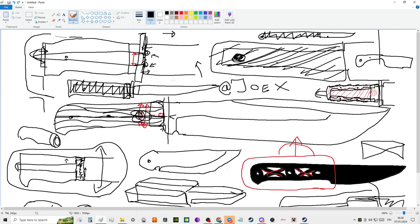But the neat thing with katanas is they have this thing where they insert the soft metal in the spine of the ingot or your billet, and they forge that out. That's actually why you should never do sanmai on really large blades, because sanmai bends and stays bent. Sanmai is not very strong at all. Homogeneous 5160 is much stronger than any sanmai, and you'll see that also on Joe X. When you watch his stuff, you'll notice that all the sanmai stuff just breaks because it's just fused together, welded together.